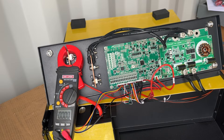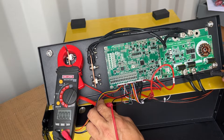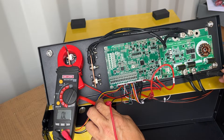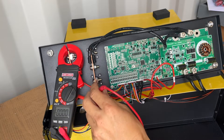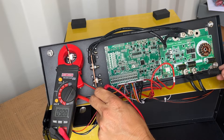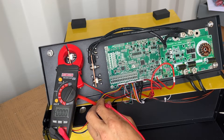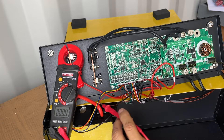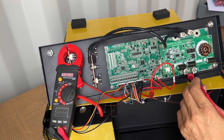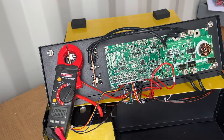I'm going to measure the bus bar, but before I do that I want to make sure there's no voltage to ground so I don't short anything out. The battery voltage — the whole pack — is reading 52.8 volts, but from positive to ground it's showing 0 volts, and from negative to ground it's also showing 0 volts. So we should be fine measuring the bus bars.